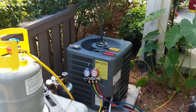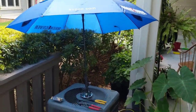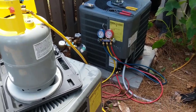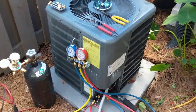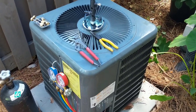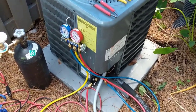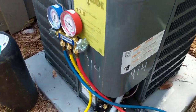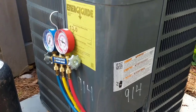What's going on guys? Got an AC unit we're working on today. Got the old Supco umbrella out, got the recovery setup. We're going to be recovering all the refrigerant out of this condenser here, and then we're going to go inside and replace the evaporator coil — it's leaking. And we're also changing out the condenser; the compressor is screaming, so the people in this first apartment can't sleep at night.